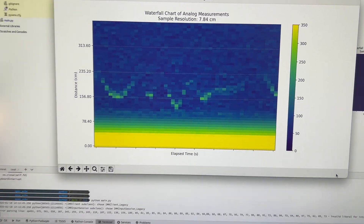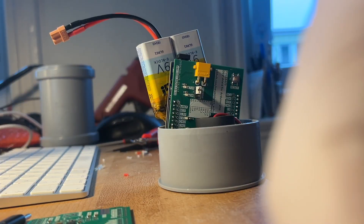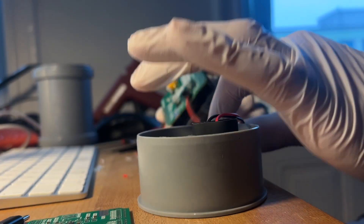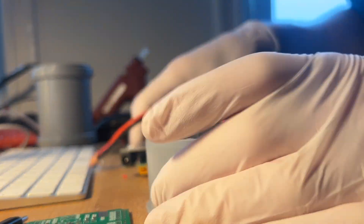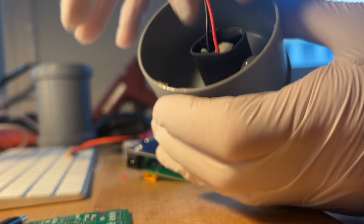As the 200kHz transducer needs a higher drive voltage, the options were quite limited because the TAS only supports 25V. First I wanted to drive the transducer with a large MOSFET and a high voltage power supply, because I was afraid to overcomplicate things with an AC matching circuit between the transformer and the transducer, but the opposite seems to be the case.